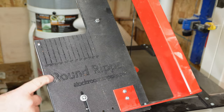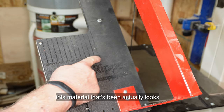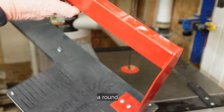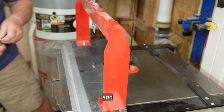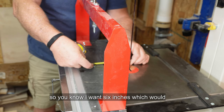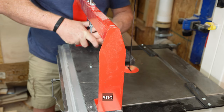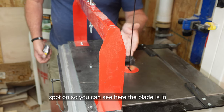The round ripper has indication marks. I'm not really a fan of this material that's been etched — it looks laser etched or CNC'd — and the numbers aren't that clear. But it doesn't really matter. If we're doing a round bowl blank, you can simply get your tape measure out and measure from the blade to that pin, which is the center of the round. I want six inches, which would be 12 inches on the marker of this tool. I'll move that back a half inch and measure from the blade to the center of the pin. Spot on — you can see the blade is in line with that 12-inch marker.